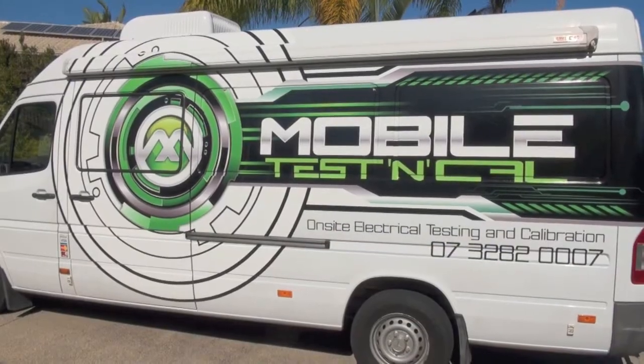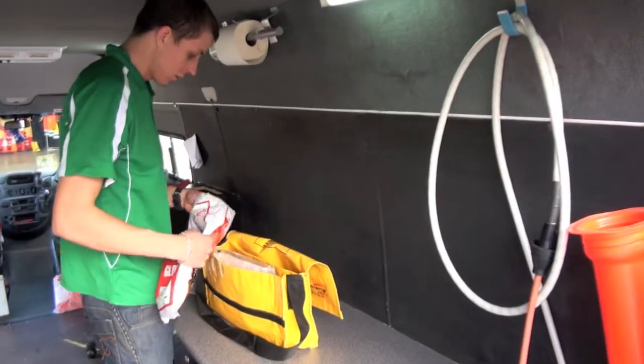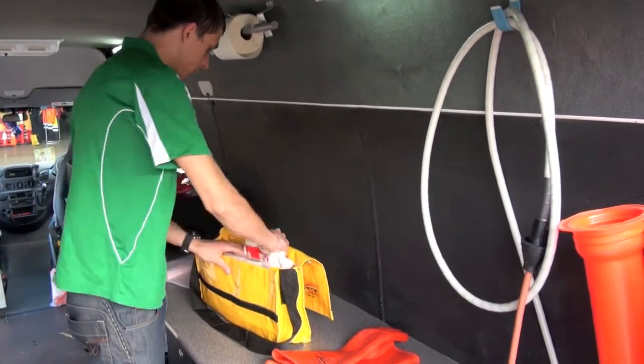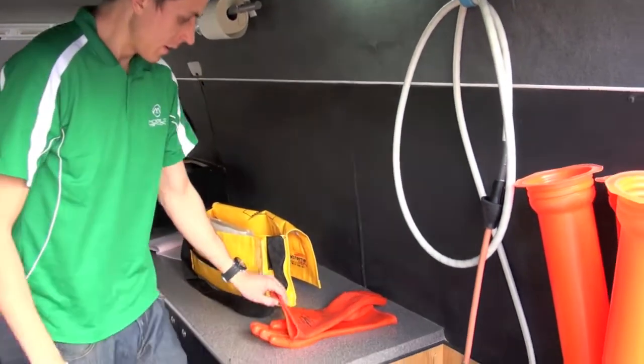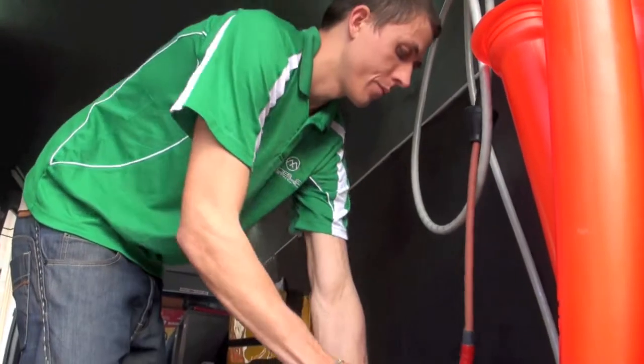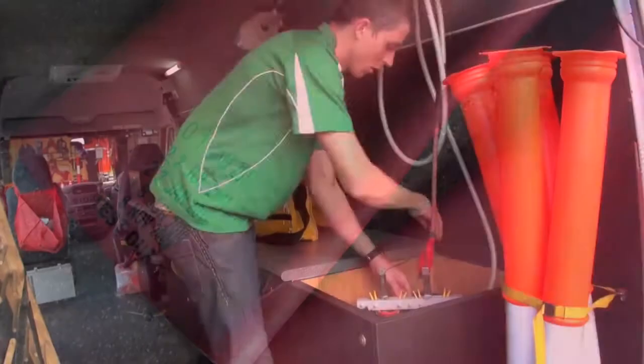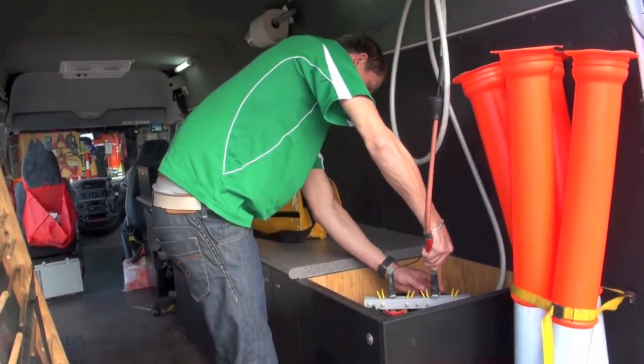The gloves and crook in the kit need to be electrically retested every 6 months after they've been put into service. If the kit is older than 6 months, the gloves and the crook will need to have a retest stamp and sticker respectively. Check to make sure the test is current.